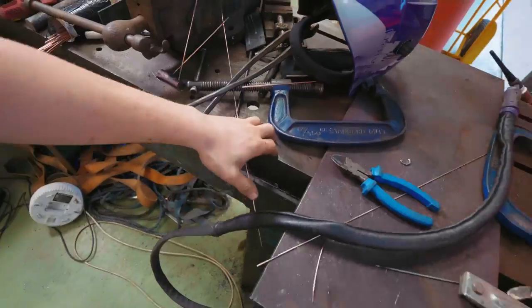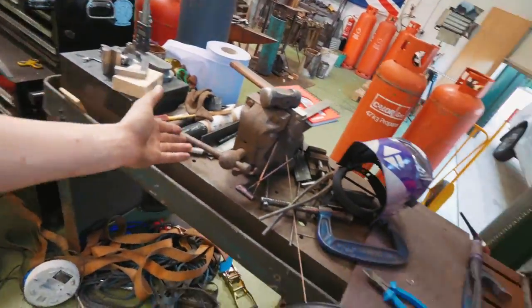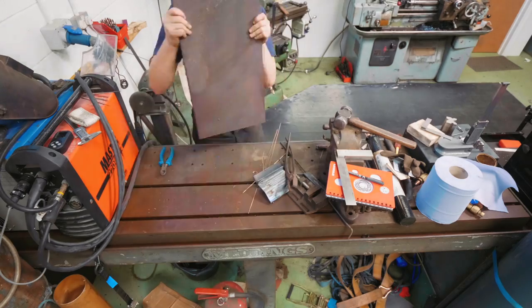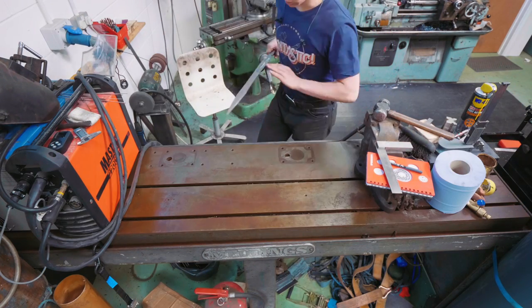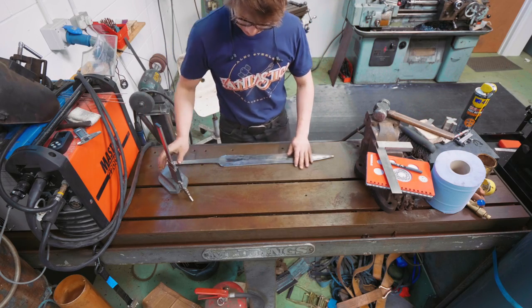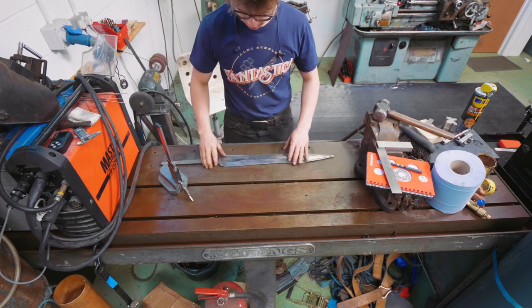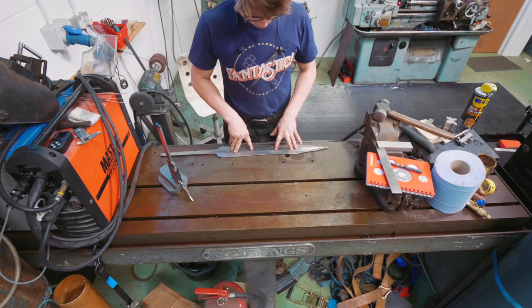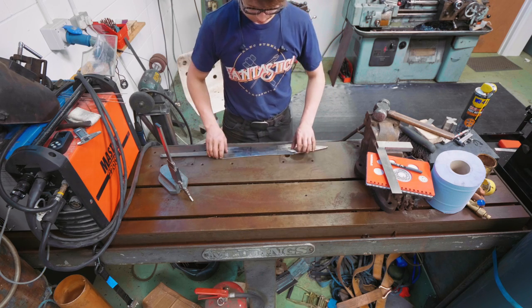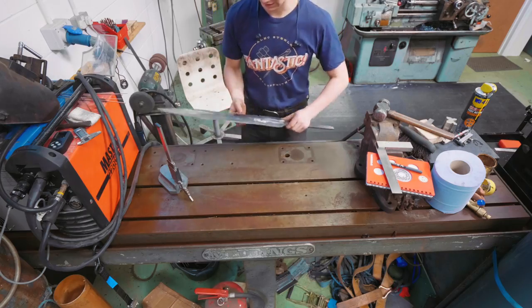This table here is actually a very flat table, however it's now become a horizontal space filled with clutter. We're going to clear this off and then use the height gauge - we're going to clamp the thing down and see if we can scribe a center line down there as evenly and centrally as possible. I have a height gauge, this table is pretty flat. There are some spots where it's obviously not flat, there's a little bit of rust. I'll put two clamps on, run the scribe along one edge, and go around like this.